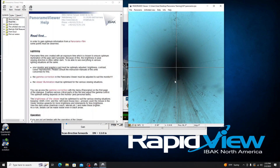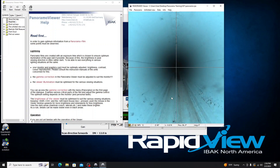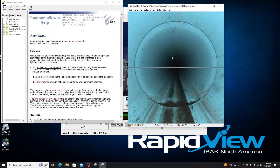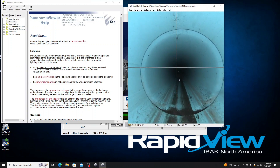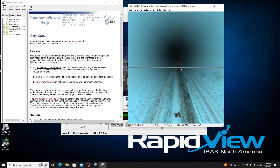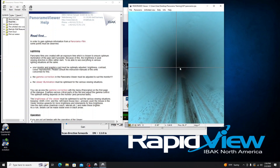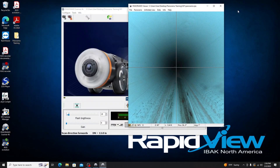From here I'll go up to the viewer, which accesses the directory we currently have set, and click on Panorama Viewer. You can see what we recorded: right-clicking in the upper section moves forward down the pipe, right-clicking in the lower section moves backward, and left-clicking lets you circle around in the direction of the arrow. This gives a full 360-degree view of every individual section of the pipe, letting you look at defects, joints, and anything else along the way.